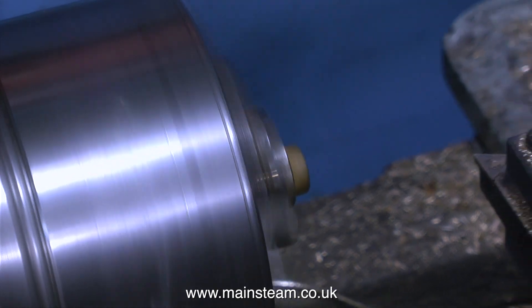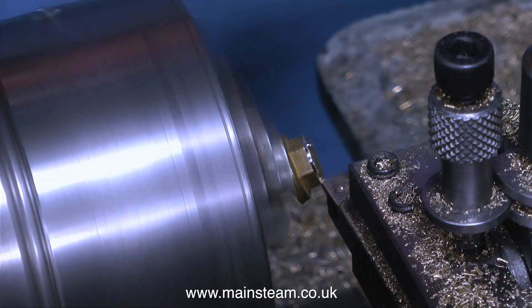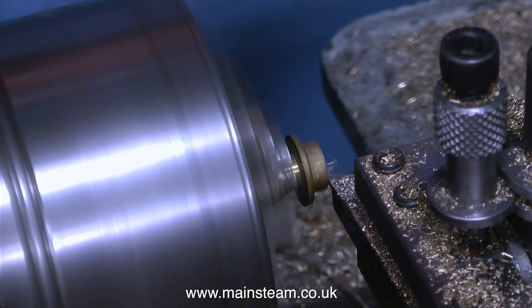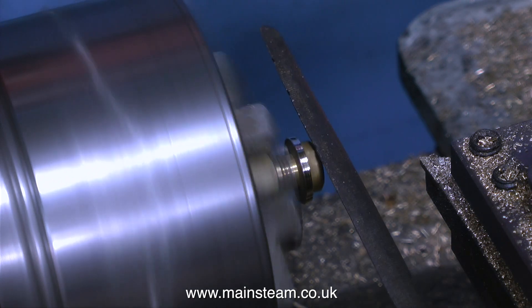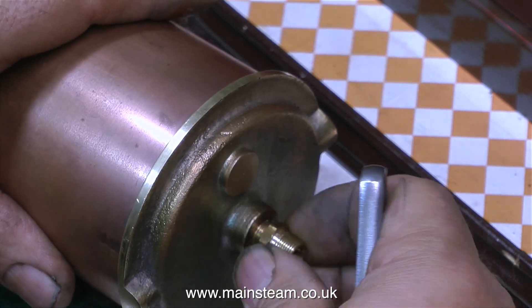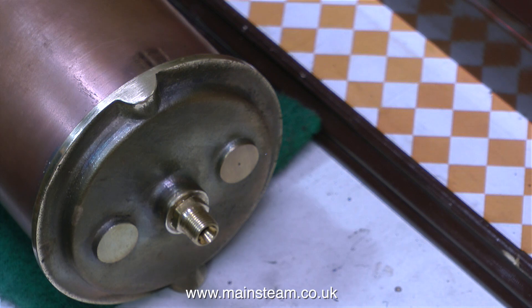I have quite a few of these commercial plugs, but they're a bit rough and ready so I'm machining one of them — oh dear. Note to self: when machining parts like this that are held lightly in the chuck by the threads, do not take a heavy cut. It's just as well I have a few of them. I threw that one away, put another one in the chuck, and this time took a much lighter cut, shaping and profiling it, then cleaning it up with a file, sandpaper, and polishing it on the polishing spindle. On the other end of the condenser I'm fitting a steam union because this is the main steam outlet to the chimney. The blanking plug just fits in the other end to make it look good.